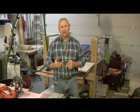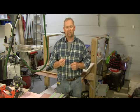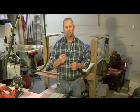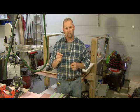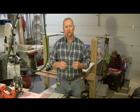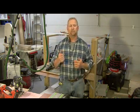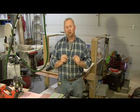Now, the other thing that you'll find in older house wiring is sometimes instead of having a breaker panel where you have breakers, when there's an overload, it opens the circuit by popping the breaker where it can just be reset. A lot of the older homes, as they're wired, have fuse panels in them. So if you overload a circuit, you blow out the fuse, and then you actually have to change out the fuse.